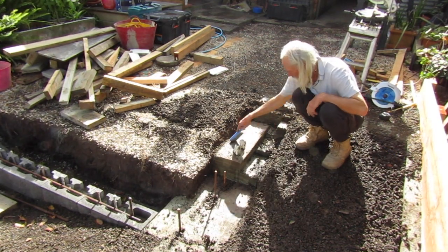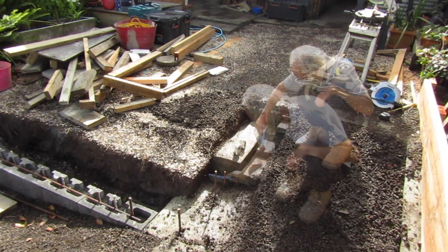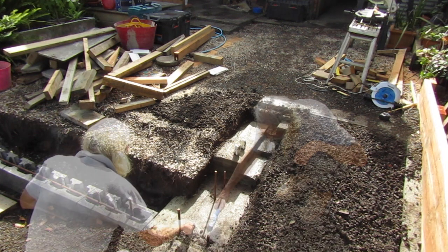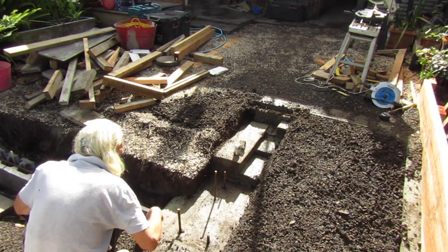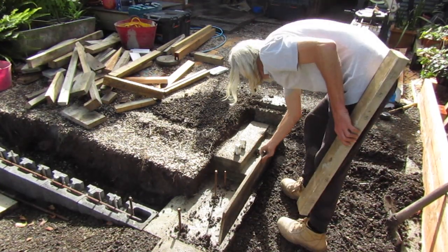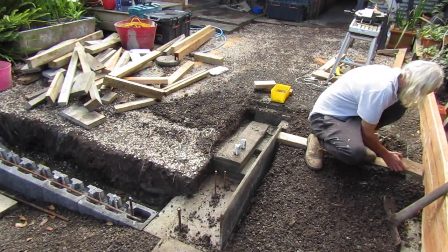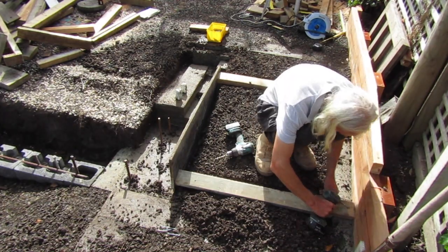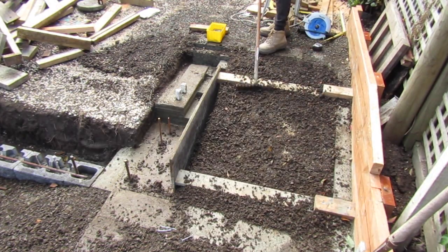This is part of the system I designed. The underground part of this wall is all solid concrete, which adds a lot of strength to the system and also saves a lot of time and resources in having to build this block to its full height underground. We're also going to have to create a little form to keep the gravel out of the area where we're going to place this block — building a small retaining wall to hold the gravel so we can still use the ramp for bringing materials and tools on site.